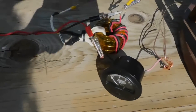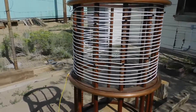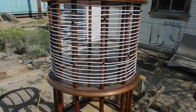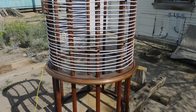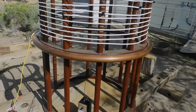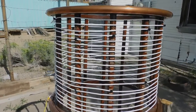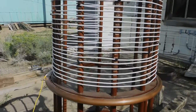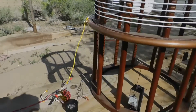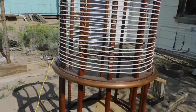The other end of that black lead leads through the yellow wire up to the base of a Tesla extra coil. This is one that was constructed by Griffin Brock earlier, I think somewhere around Christmas last year, donated for the cause. This is in the 160 meter band, so between 1.8 and 2 megacycles. Below that we have a field strength meter used for tuning the electrostatic field, and the measured drive impedance using the VNA of this coil is approximately 50 ohms or just below. That's one of the primary reasons why the one-to-one impedance match transformer seems to work so well.